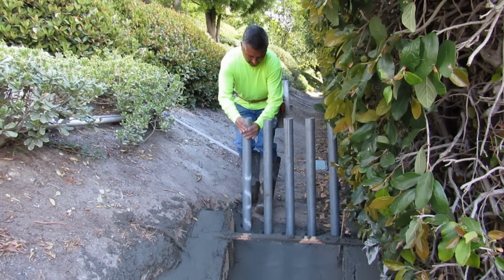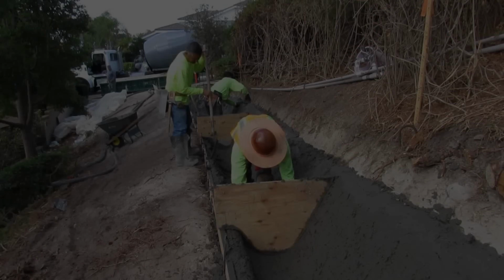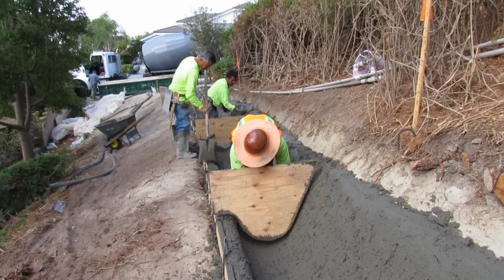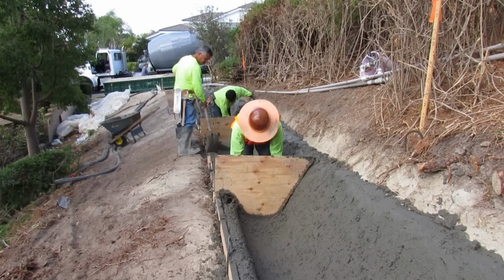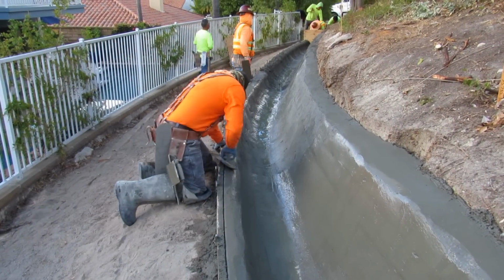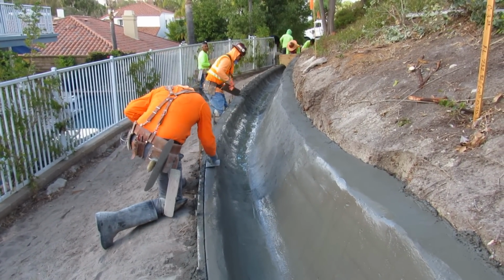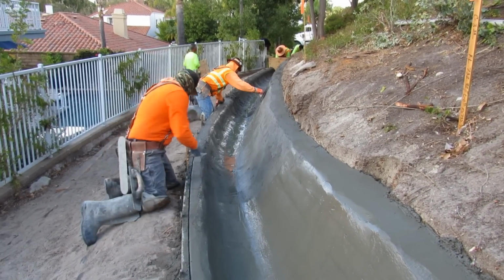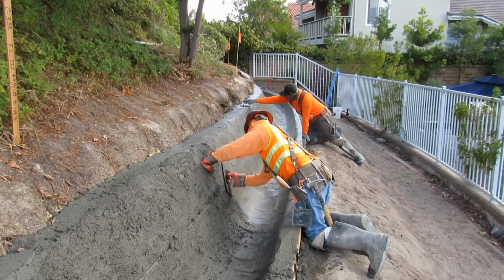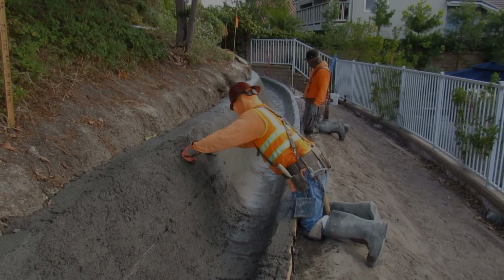And these poles, we got to cut them down and fill them with concrete and then cone the top of them. That's what the county wanted. And we got a guy going ahead of him with a template and then the guy behind him, so you're not dragging so much in there. Like this went really fast. We laid this whole load down in probably 30 minutes. I just had the pump turned down as slow as it could go so it wouldn't run off the hill where I stacked it up there. Everyone was asking me how I was going to do it, the county guys and stuff, and now they can see how I did it.